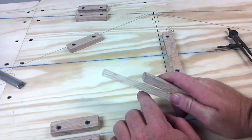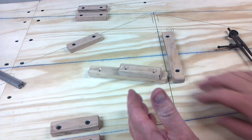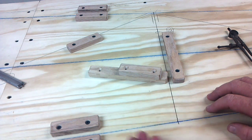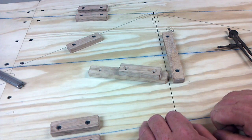I'm still going forward with it, but three quarter is smarter because when you lay these jig blocks down you want to raise up the tubing so when you do weld the joint you can put some metal underneath it and protect the wood. But I got kind of a game plan going so I'm going to stick with the half inch.